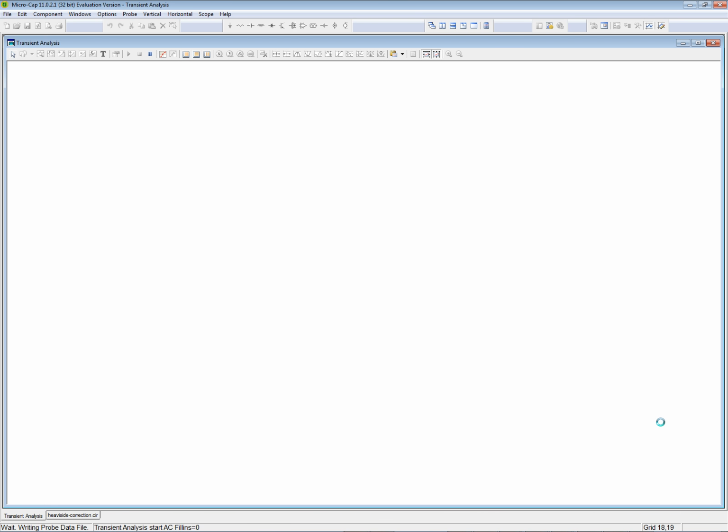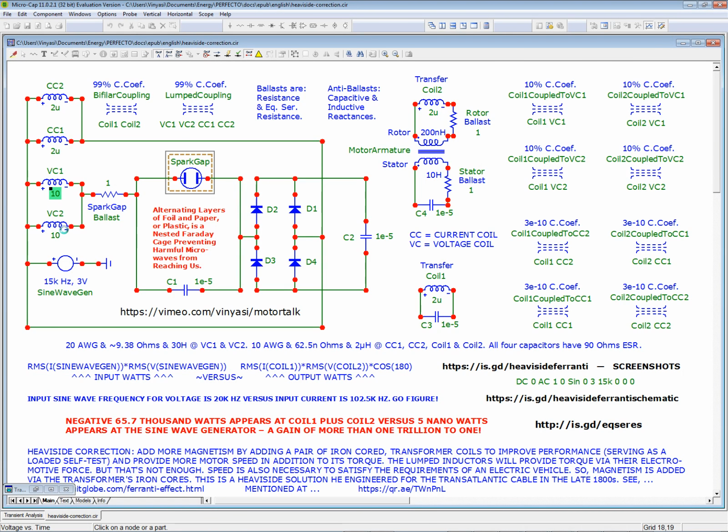While I'm thinking of it, I might as well add: frequency stresses capacitors, but coils actually benefit from frequency. And instead of frequency stressing coils, it's low frequency that stresses coils. This is what I'm getting from the error messages when I fool around with this thing. If I lower the henries, the inductance on this pair of coils over here, I can get an error message.